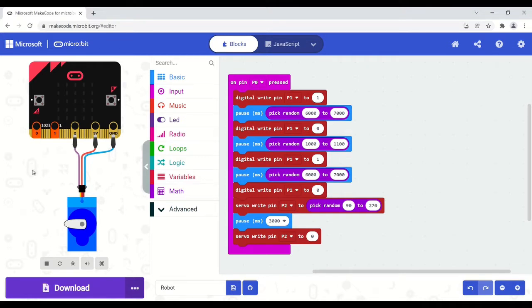Pin one sends a message out to the Furby eyes to start blinking, and that's on two cycles — it does one for a random amount of time and a second one for another random amount of time, before then working the servo motor, which makes the arrow spin round a random number of degrees. So we don't know what decision we're getting when we put our money in — we can get a yes, a no, or an unclear — one of the three. And we don't know which one we're getting because it's all random, which is brilliant.